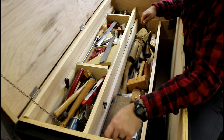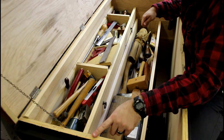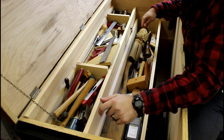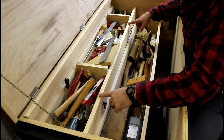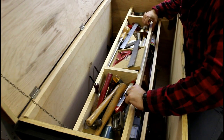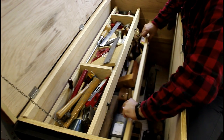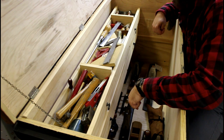I built mine in pretty modern ways I guess. I constructed it with birch cabinet-grade plywood, did all the trim in solid poplar, and the tills are made out of pine with the bottoms made out of oak if I remember right. The tills slide on runners - I have two tills here that slide out of the way so you can access the bottom where I keep most of my hand planes.